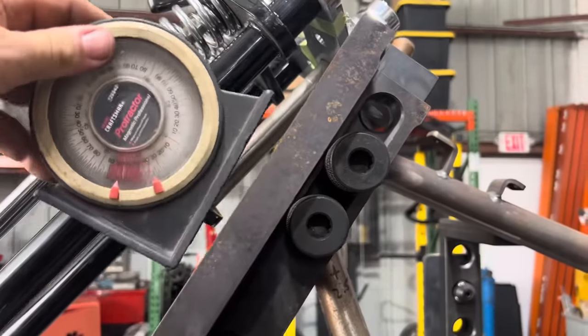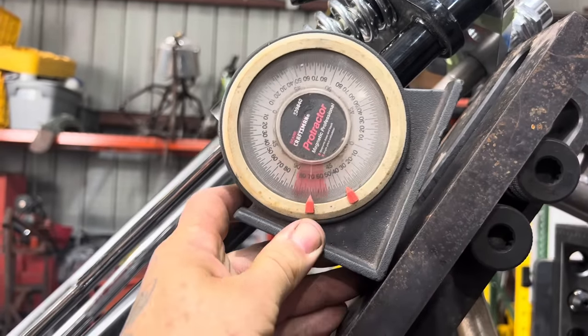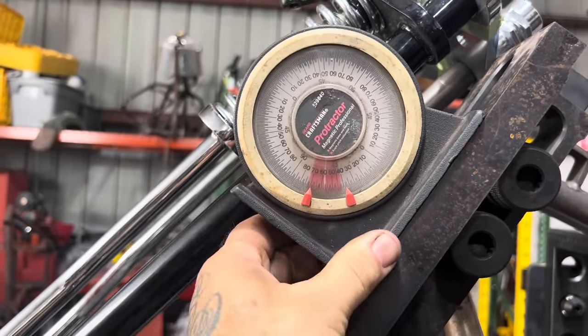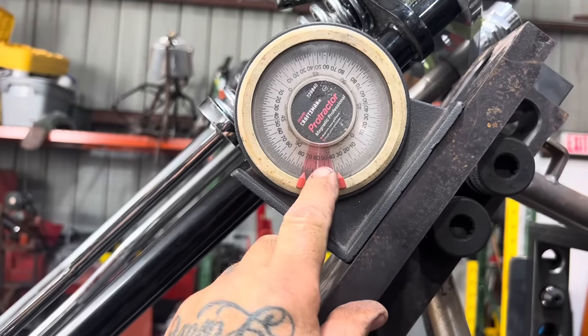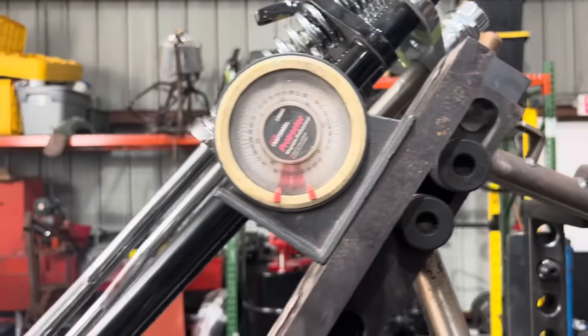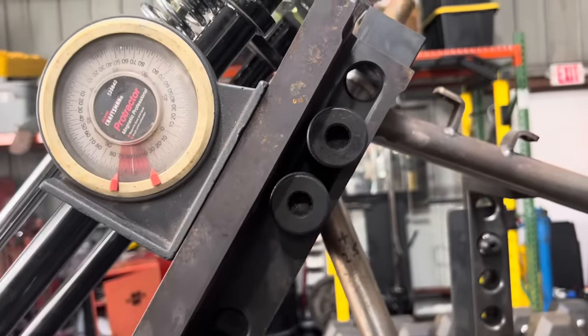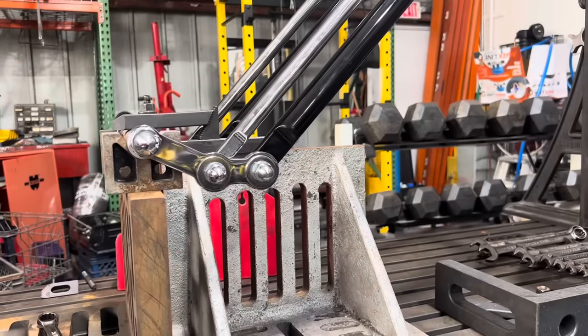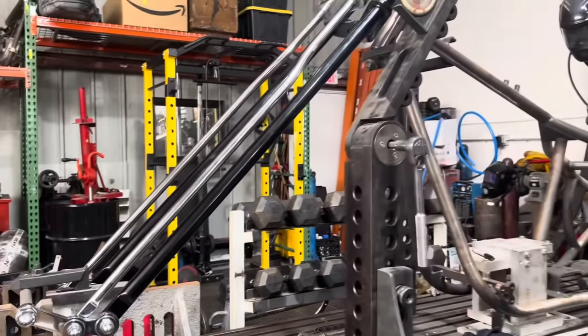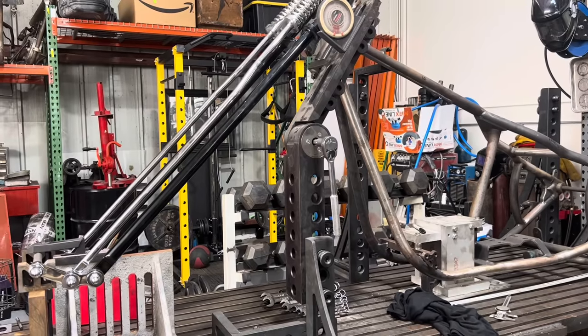As I said, I've got a 33 degree rake. If the neck was straight up and down, you'd have zero rake, and you rake it back 33 degrees. So this gravity protractor is gonna show you that I have 33 degrees rake on it. But I wanna run an 18 inch over Springer front end. And that 18 inch Springer is not gonna work with 33 degree rake. So what I've done is set the Springer up where I want it to ride on the frame, and I'm gonna go back and cut the neck and rake